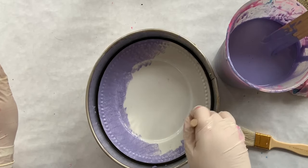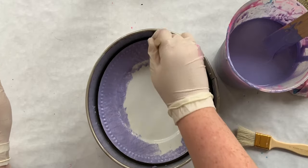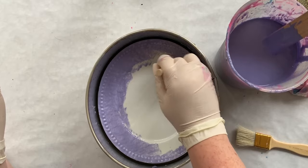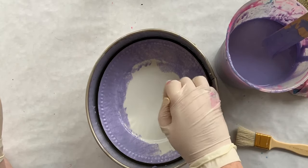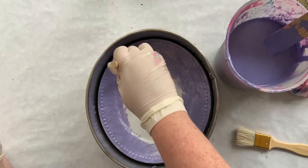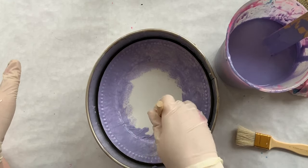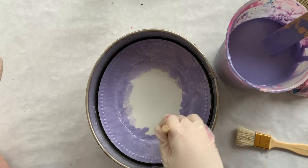We want to work semi-fast because this mold material doesn't have a super long working time. You've got a little bit, but within 30, 40 minutes, it's going to start being harder to work with. Get this groove real well because I had to sand. Had a lot of problems with that on the other mold. Had to sand a lot. Not of the mold, of the resin plate I made. And I will show you when I'm all done with this. However this mold turns out, and however the old mold turned out. I know how the old mold turned out.